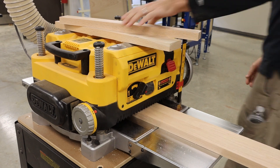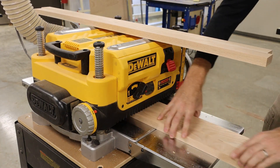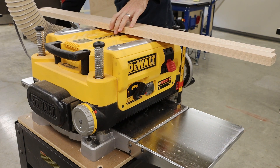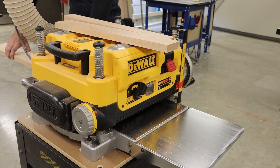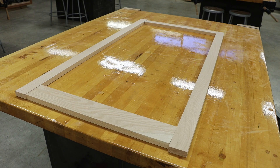Throughout this process, I am alternating sides so I can plane and clean up both faces of the boards. My objective is to reach three-fourths of an inch to match that finished thickness measurement. And when finished, all of my stiles and rails have a finished thickness of three-fourths of an inch.